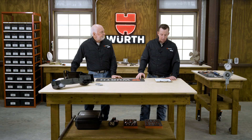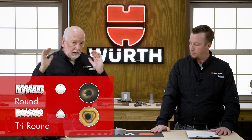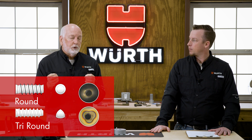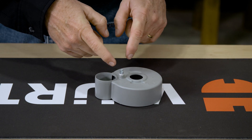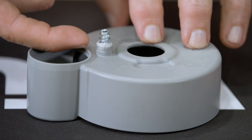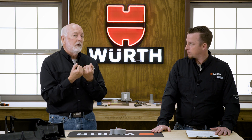Let's look at tri-roundular screws. They're good in certain plastic materials, but in high flexural modulus materials, that tri-roundular lobing creates high stress on the sidewalls — too much stress. We have a piece here where we put tri-roundular screws in, and what you're going to see is what we call hoop stress: a whitening around the screw and a visible crack line. That will continue to crack out over time. If you ever see hoop stress taking place, you have an assembly problem.